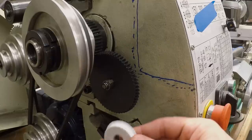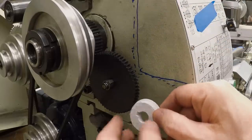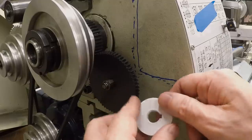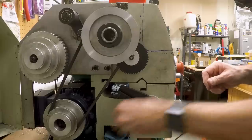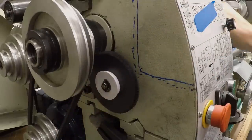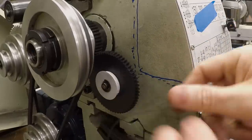In the meantime, I just made a pulley on my 3D printer. This is the same 60-tooth pulley I have in metal, but 3D printed with the keyway in it. I went ahead and put a single flange on it — it's hard to print a pulley with two flanges because you need support material in between. This will fit right on the idler shaft, and then we can just put in the e-clip to lock it in place.